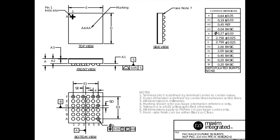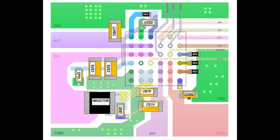The only downside for me is that it's a BGA with 0.4 millimeter pitch. You will need via-in-pad, so you're going to have to use a fairly non-trivial PCB — not the cheapest you could get. Four-layer boards are also going to be needed. In the recommended layout, some of the inner setting pins — not the power pins — require going through the pad and down to another layer to route them out. There are other chips in this family that come in a QFN-style package, so if BGA isn't your thing, look for 'DigiKey MAX 777' and you can see the rest of the family — maybe not quite the current capability or configurability, but available in non-BGA.